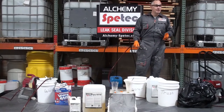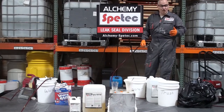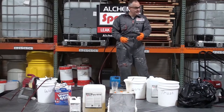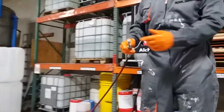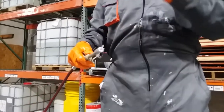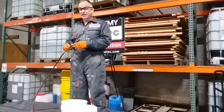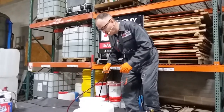What did I do wrong? Anybody watching from the beginning? When I was done I was focused on talking and forgot to put my packer in here. You can see it's starting to get a little foam around there. On job sites something can happen where your grout travels and you forget — now you've got five minutes to change this out. You want to have extra couplers on site so you don't spend 20 minutes cleaning this. These couplers aren't bad when grouted, but they do take a while to clean, especially on shutdown work.